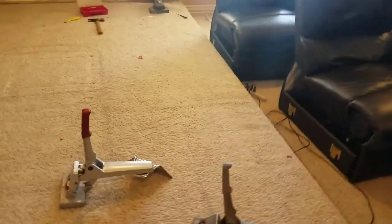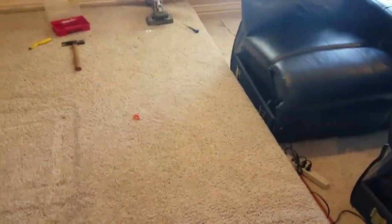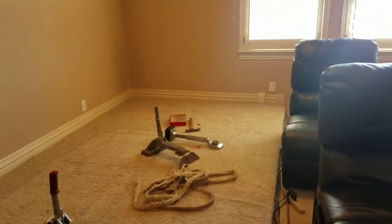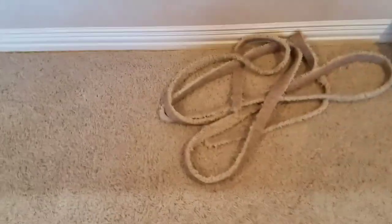Finally at the very tail end of this. To explain what I did: I didn't pull this up along here — I stretched the carpet, it bowed, so I pulled it this way. I've got some carpet to cut off here and there. I had to pull it a little this direction and cut some off in order to get this front edge to stretch without taking it off the edge. I'm going to tuck all this in and cut it off right quick. And we're all finished at the top here. This is how much was taken off at the top — it could come off of there, a section here. And this piece here is what came off the lower section.